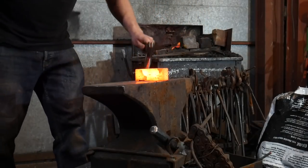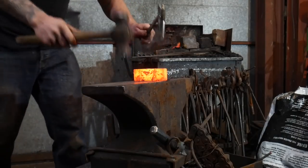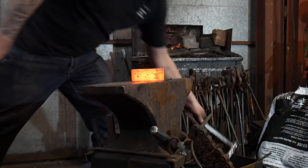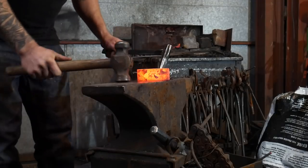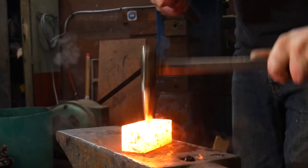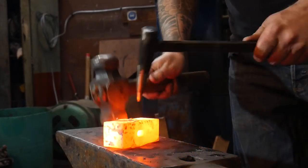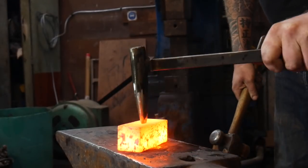I'm just going to bring this over and out. The rotation through this way is going to take out any errors we've got. I'm going to rotate that and continue doing this — take it out after every time. Leaving it in the work builds up contact time, which will ultimately result in this getting hot and bending or mushrooming. So this would be the last heat I need here. I'm going to take the hammer eye punch, come through, rotate it, get this out and quenched off. I'll flip it over and I can see the negative of the hammer eye punch in the other side of the hole.